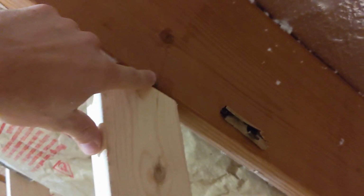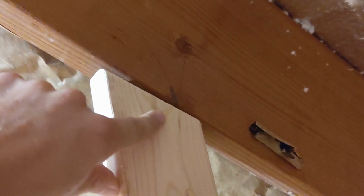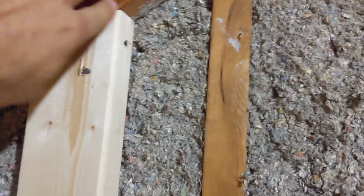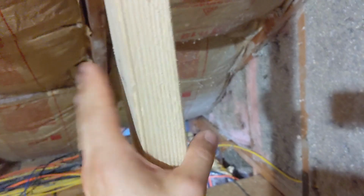cripples. So you can see here, this is a level mark down to there, and how that mark is decided is by what the original was, which is over here. So up against this wall, this is the end wall, nothing fell here because it was well supported, and so this is the level mark. Whatever size this cripple is here should determine the rest of these.